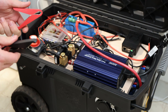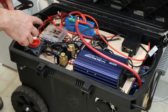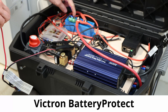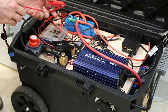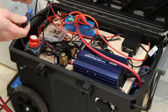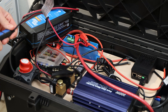Currently the system is on and I want to attach the Victron charger. We'll use those two connectors and attach it. Since this is a system which is up and running and this is the Victron smart charger, I'll put it to the load so it recognizes the power going back in. I put it in here — here's the positive — and connect this because this goes back to the battery. Now I'm just plugging it in and connecting those two to each other.